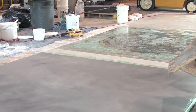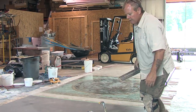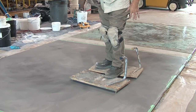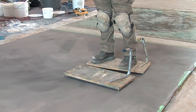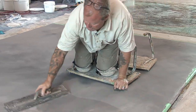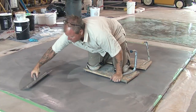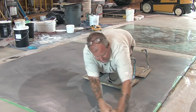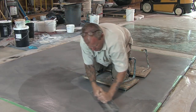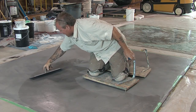Roughly 25 to 30 minutes has transpired and more or less the whole surface has dulled out, meaning there are no damp or moist spots, so I'm going to proceed with my second troweling step. Gingerly — you don't want to step with your weight not distributed evenly. Remember my first pass went this direction, so now I'm going to cross it. This is where you really get that beautiful burnished appearance. There's just enough surface moisture to really blend the color. This type of troweling is what really takes it over the top, and you'll actually see a shine — I'll be able to polish this out.